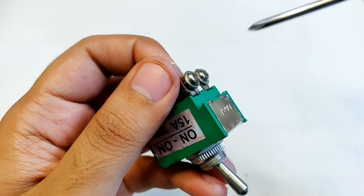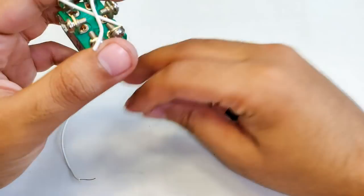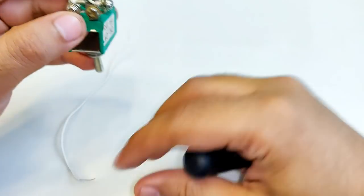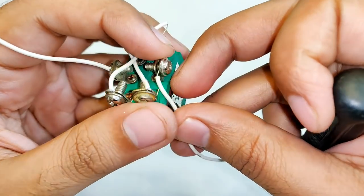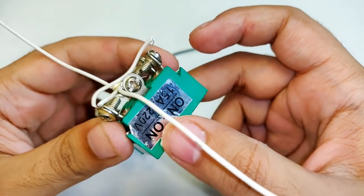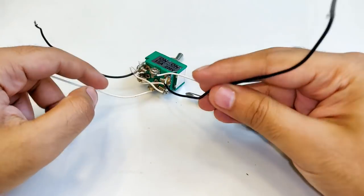We will have to take the corner poles and make a cross with it using wires. When you do this, always use thicker wires - here I am demonstrating it with just a 24 volt battery setup so I am using thin wires, but this motor is really powerful and if it is to be operated at 220 volts you will need thicker wires. Take two long wires of the same color and connect them to the poles in the middle. On the printed side - on-off 15 amps 220 volts - these two points will be connected with the black wires. In total there are four wires coming out from this double pole double throw switch.